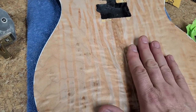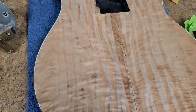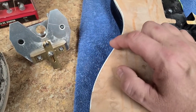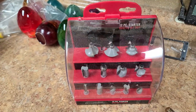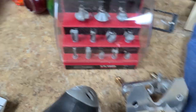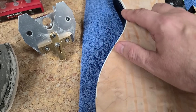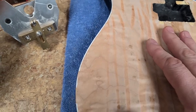Not a big deal — it can be refinished. 80 grit sandpaper will cut through this pretty quick as long as the glue underneath is fully cured, so it doesn't gum up the paper. The binding kind of poked out around the edges — the glue doesn't adhere to plastic so it came off easy when I pulled it off. But I have a plan: I've got router bits over here, some with a bearing on top, so the bearing will ride the edge of the body itself, cutting all the excess off the veneer without damaging the body or the nice binding on here.